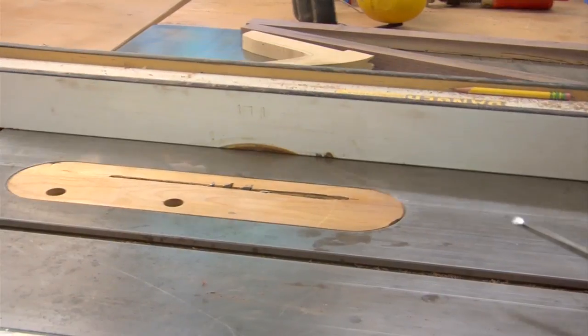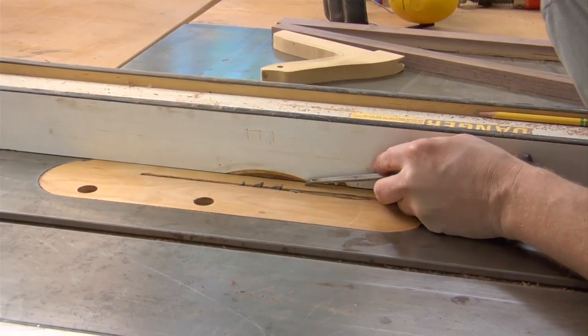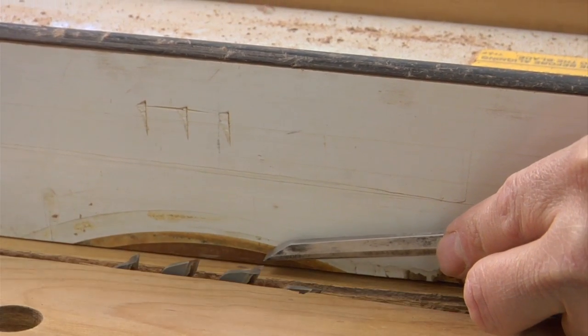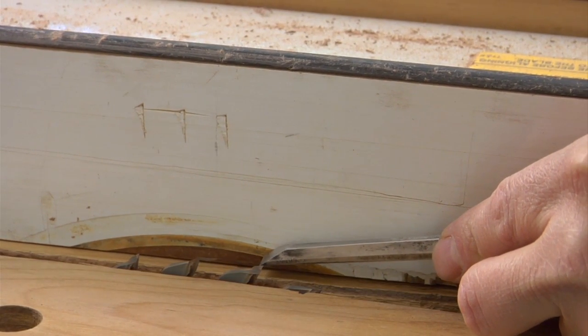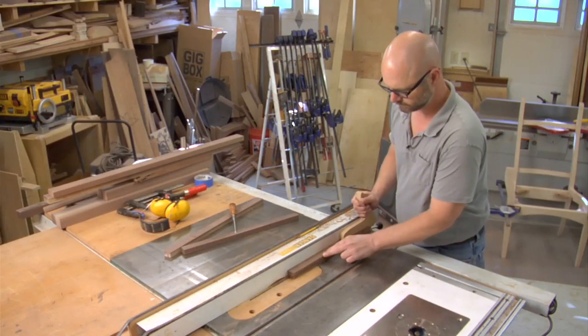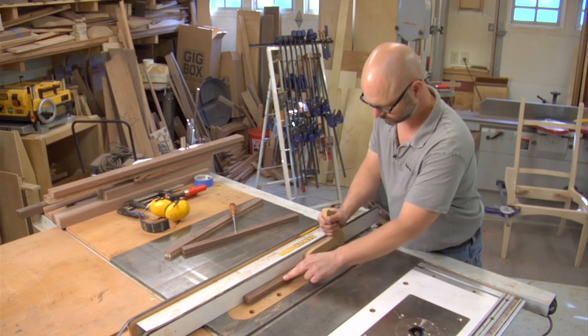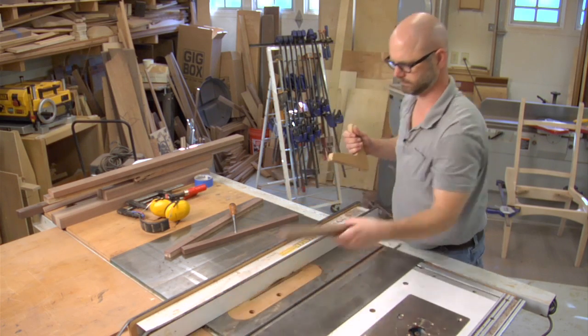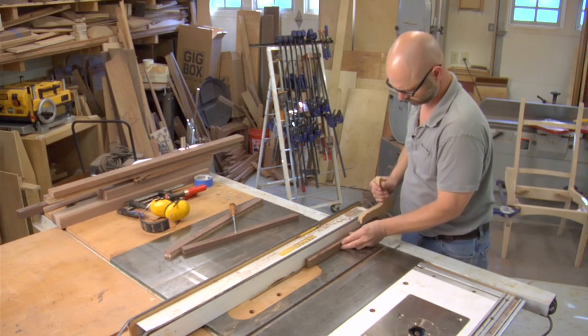At the table saw, set the blade at whatever width you want your pegs to be. In this case, they're about 1/4 inch. You make your life a lot easier if you make pegs that match the width of one of your chisels or are just a hair wider. Set the blade height just under 1/4 inch thick so that you don't cut the pegging stock free, because that can cause it to kick back towards you as you're cutting.